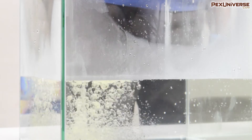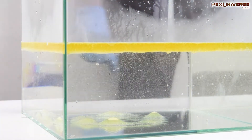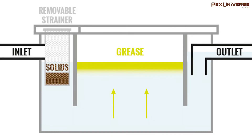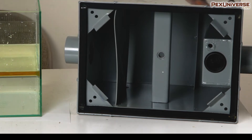When the water is slowed down, it cools and allows the grease to separate from the water. The cooled water is then able to exit while the grease is captured on the top section. The size of the grease trap depends upon the amount of waste that is being produced in a given facility based on the dimensions of the waste sink itself. An example in a commercial environment might be sized according to the rate of the incoming flow in gallons per minute — in other words, the GPM.